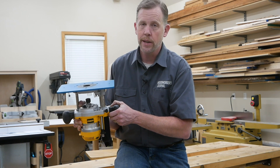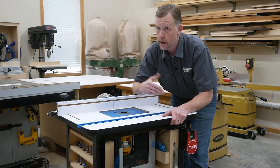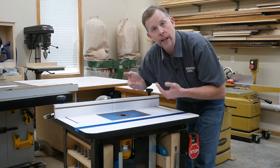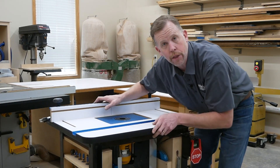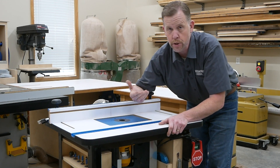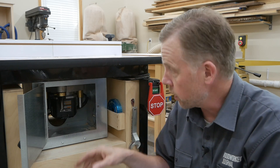This is a super economical approach and it works okay, but it does have some drawbacks. With a plate system like this, if your router doesn't have through-the-base bit height adjustment, every time you want to change bit heights or change bits, you either have to lift the plate and the router out of the router table, or reach around or crouch down and make the adjustments underneath the router table. And that's a hassle, particularly if crouching or bending over is hard for you.